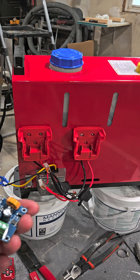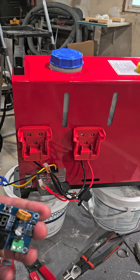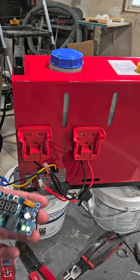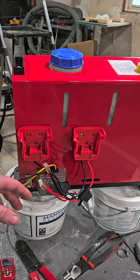Basically you run your 18 volts from your batteries into one side, and then the 18 volt comes back out on the other side and you run that to your converter. All this does is let you preset your low voltage shutoff so it doesn't drain the batteries all the way down and destroy them. This isn't a long-term solution, but I just thought it was something fun to do — you can do it however you want.